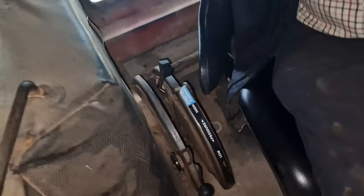Draft means your linkage sensing the amount of pull on the back - that way the tractor will sense how hard it's working. This is the Massey Ferguson system, which Harry Ferguson designed and worked out. So it transfers the draft of the plough, or the tine pulling into the ground, onto the back wheels to give you grip. You don't need weight - it's transferring that pull into the ground onto the back wheels, which we call draft. I'll show you that on the back quickly, how that works.